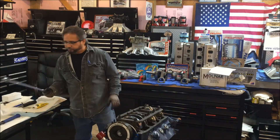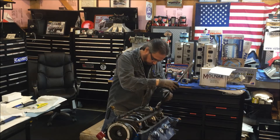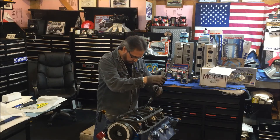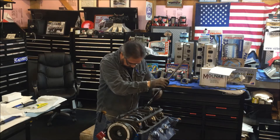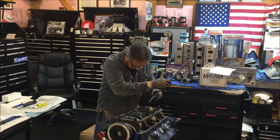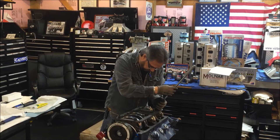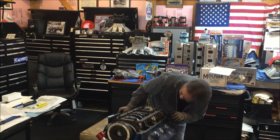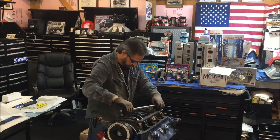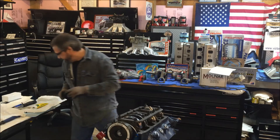It's the same procedure as before - I'm going to snug it up. It's got a different feel to it, that's for sure. It's smoother, actually. I can see a little bit being expressed as I tighten the cap mating surfaces down, and I can see the parting surfaces go right together, no issue. I'll snug it a little bit and then put in my feeler gauge.